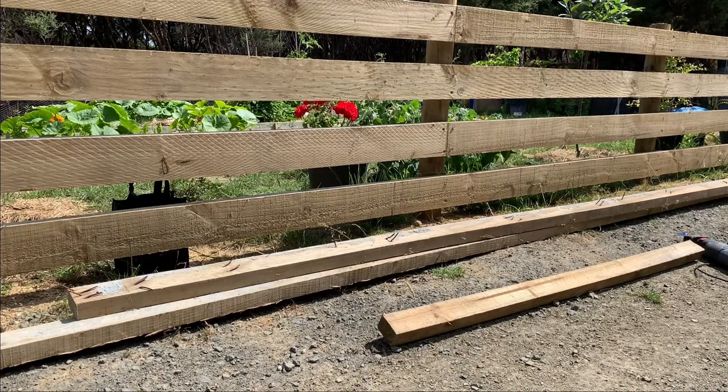We've got some 3x2s left over from when we built our house. We used them as shutters for the brick rebate, where the bricks sit onto the slab of the house, and that's all treated wood. So we've got that left over, and I think that'll make the perfect frame for the trellis we need to build. We'll just denail it and reuse that wood for our frame.